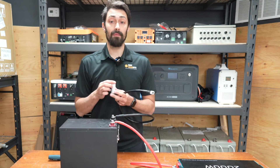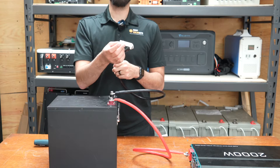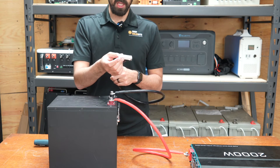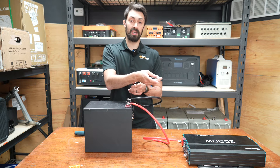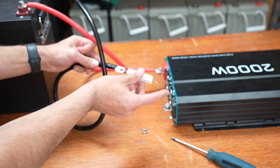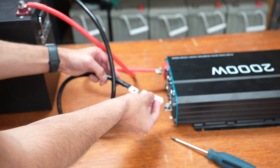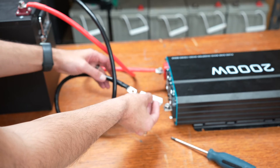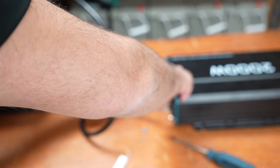In order to get around that, you'll pick up one of these resistors. They're super cheap on Amazon. You loop one end around the piece of cable that comes from the battery and you touch the other end to the terminal where you're going to connect on your inverter. I'm going to touch one end around the resistor here, and this other end I'm going to touch on the terminal that I want to connect. Just a couple of seconds and no spark — now we're able to connect.